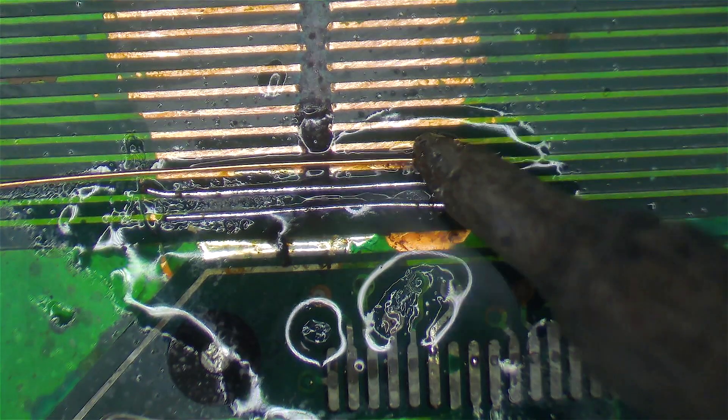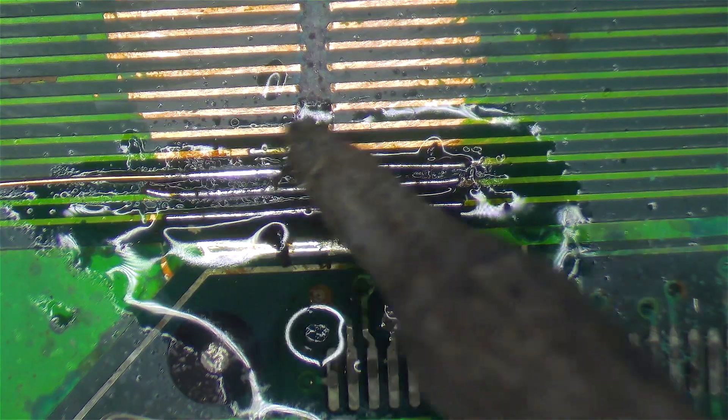One thing I must say is that all fluxes performed well. I've tried lots of different brand fluxes over the years and used some absolute shockers — ones I've thrown away after using only once. Among these Steerey fluxes, I definitely found ones I preferred, but there really wasn't a dud in the lot. The Hydra MA really surprised me. As a water-soluble flux, I assumed it would just boil away into nothingness, but it was nice and clear, had a mild odour, good performance, and was easy to clean. It's also REACH compliant, so this one ticks lots of boxes.